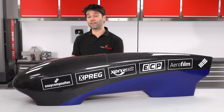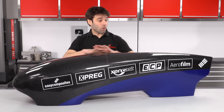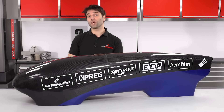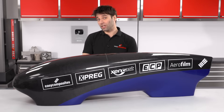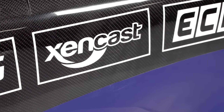The reason that you might use this mouldless method over the traditional pattern mould and moulding really comes down to time and expense. Creating a one-off part like this using this method is quite inexpensive and fast by comparison. It also has the advantage that you don't need any specialist tools or equipment — just a suitable working environment and the right materials. The results that you're going to get won't rival a moulded part in either strength, weight or accuracy, but the results still are very viable, and so for one-off components it might be a very practical method to use.